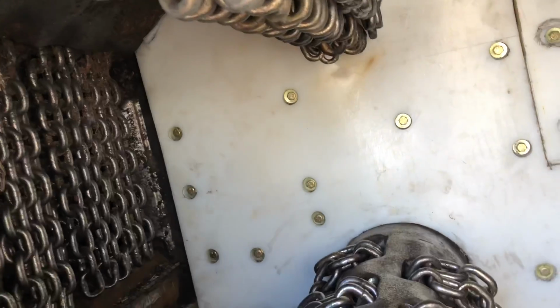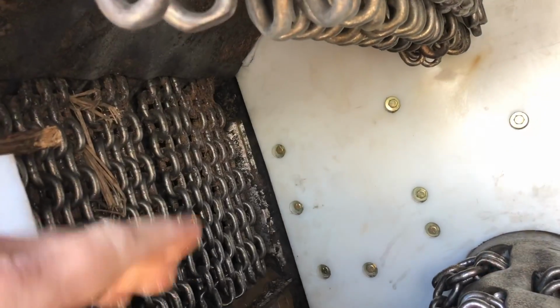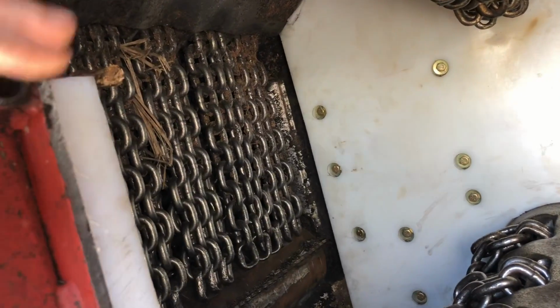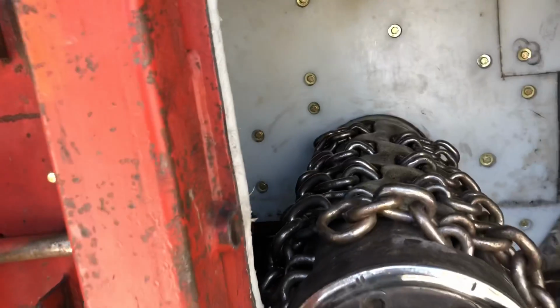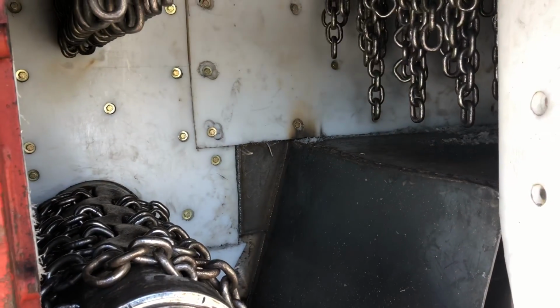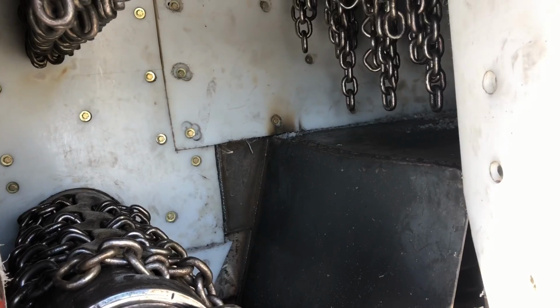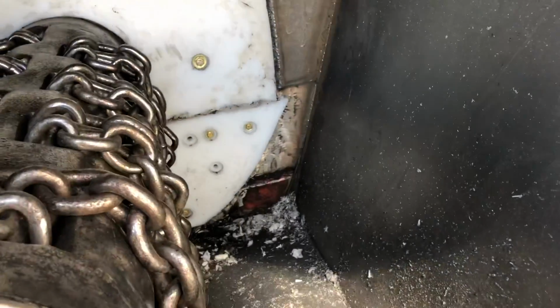That's called curtain chain. All the trees go through all that. This is all to stop chain going through your knives, also to stop any bark, anything getting up in there, and that chain rides the trees through and knocks off any bark that maybe is laying on the tree. That's a little bit how these flails work. Yeah, we redesigned this whole thing here, and I think the gully's going to work good.